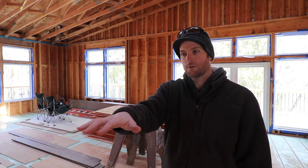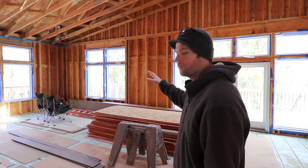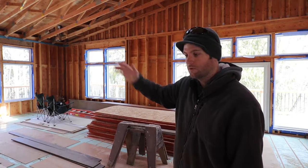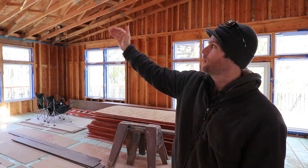Also in the crawl space I'll build another air barrier for that floor. And the walls have got the blue skin for an air barrier, and the blue skin links up with the floor to create an airtight system. The last piece of that system will be the top.